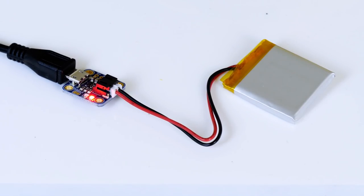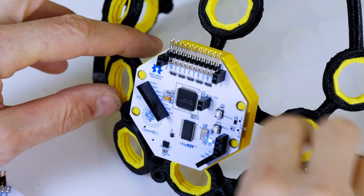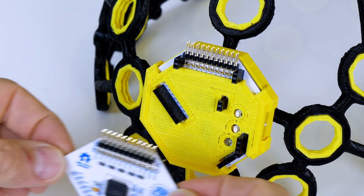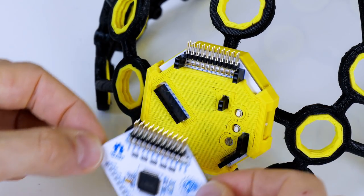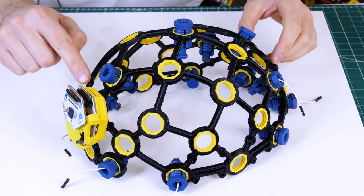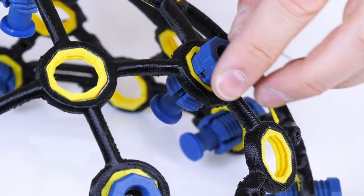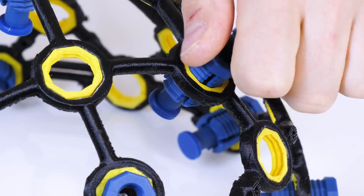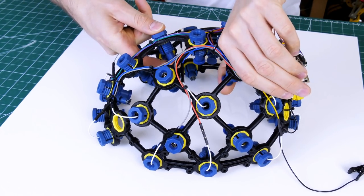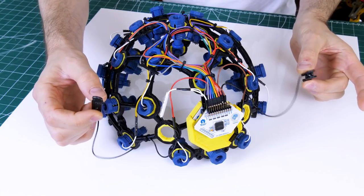There is a power switch on the side labelled BLE and PC — I assume we need the BLE mode to connect via Bluetooth. There's a 3D-printed cover that goes on top, and then the 16 or 8-channel expansion board plugs in over it. I've fitted 10 electrodes so far and the rest are just plungers for comfort fit. I need to wire the first eight to the main board and another six plus two to the daisy chain board. All electrodes are screw-thread adjustable for head contact.